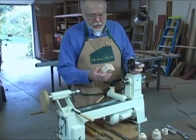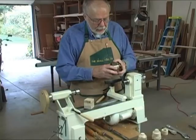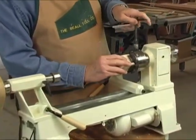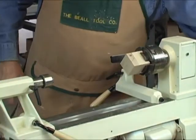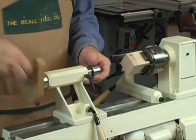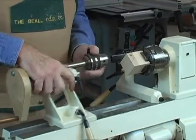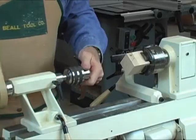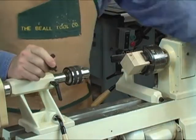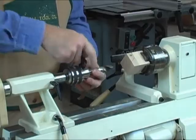I've prepared a block right here — it's glued up out of three pieces of three-quarter inch maple by two inch square. I'm going to put that in my chuck on the lathe, tighten that up, and then we're going to use our tail stock to bore a hole for the tap to thread. I'm going to use a nice drill chuck and a one inch eight tap, and to drill the hole for that we need a seven-eighth bit because you always drill one-eighth under the size that you're going to use.